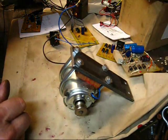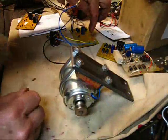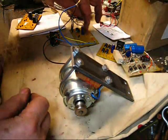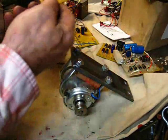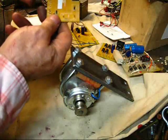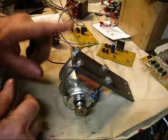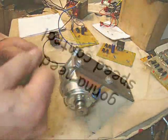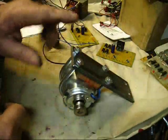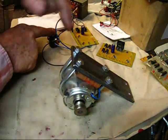This is the electrical system as of where I am today. What I have is a transformer — 115 volts down to 24 volts. The standing voltage on the output of this rectifier, which I saved out of a piece of medical equipment: these printed circuit boards have the bridge rectifier. All you do is cut off what you don't need and you've got a perfectly good high-quality bridge rectifier. In my case I'm putting 115 volts into the transformer and getting 24.5 volts output. This is a 24-volt motor. I'm going to go ahead and show you — look at this, see it running? Watch this.